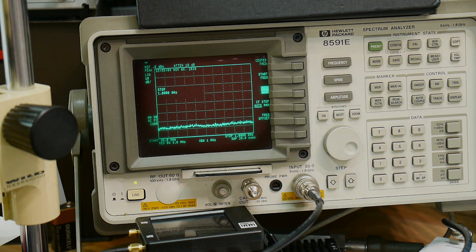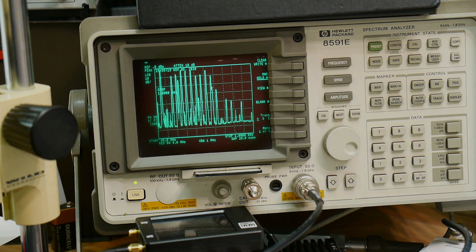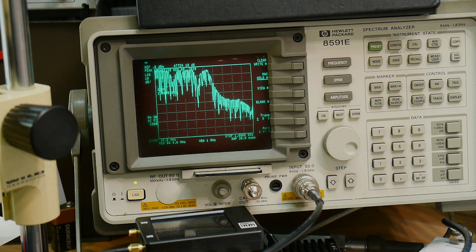Okay, so we're sweeping the same range. Let me see if I can inject a signal here — and there we go with all of its harmonics. Let me turn on the max hold and we will see what kind of picture builds up. Well, interestingly it's giving us the same picture that the NanoVNA gave. Those dips there are real. Well, that's too bad. I have it stepping every five megahertz so it takes a while to fill in. But yeah, those dips are real.